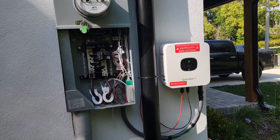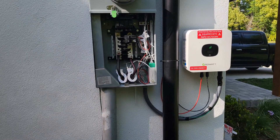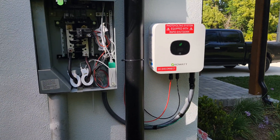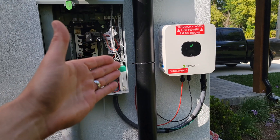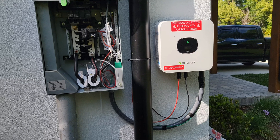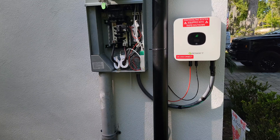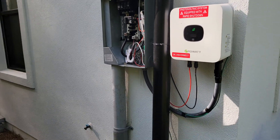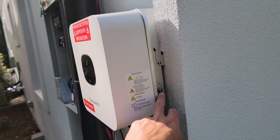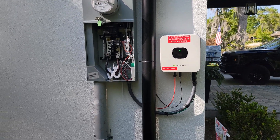I've got it located right next to my meter and I'm going to show you how I wired it up, because there's a little bit of confusion with the Growatt models in the United States. I think you can literally buy all these grid tie inverters and all of them will work in the US — you just have to set it for the United States and then it'll perform how it should. The only other difference is that the US model requires a ground on the outside.